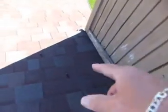And you can see here there are screws that have come out of the siding here. This is a prior repair. I would imagine there was an aerial here and that's been taken up, and you see you've got a bit of a board here to actually take the weight of the aerial. That needs to be sealed. General condition of the siding of the chimney is poor. It needs to be repainted.